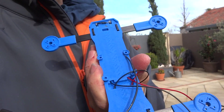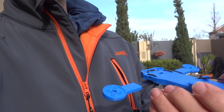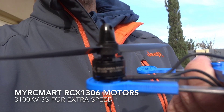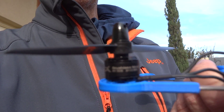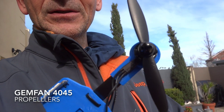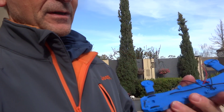The tracks are all integrated for the electrical wiring. We're using new motors — the RCX 1306 motors, the 3100KV version. We're going to run these on 3S and hope to get some really good speed out of them. We've gone for the GEMFAN 40x45 props. I've been able to significantly reduce the footprint of this quad — make it even smaller yet faster.